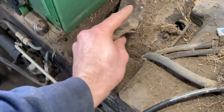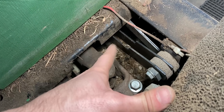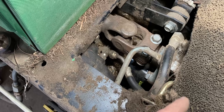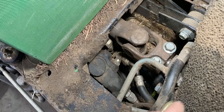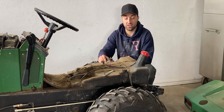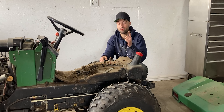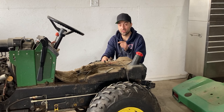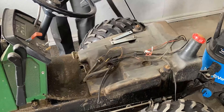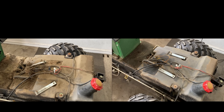I'm going to open up the mat for the first time and have a look underneath — yeah, it's pretty dirty down there. Off to the right there's a lot of debris, probably two inches of grass. Luckily there's nothing around the input shaft of the hydraulic motor or some of these hydraulic lines going into the valve block, so I'm pretty happy about that. But this must be cleaned up. I'm going to get a vacuum cleaner and clean everything above the frame rails, then go underneath and remove a mesh screen — I have a good feeling there's a lot of debris underneath this tractor.